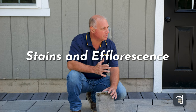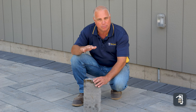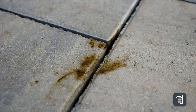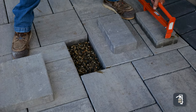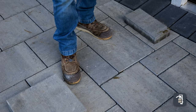Another thing to point out is stains on your patio. Sometimes in construction you're going to get dirt and debris. These are generally not impregnated into the pores of the pavers — just a surface stain that will come out when you sweep, as the abrasiveness of your joint fill material acts like sandpaper. However, a stain like a leaf stain can really get down in there and requires a cleaner. Make sure you address it before sweeping and compacting.